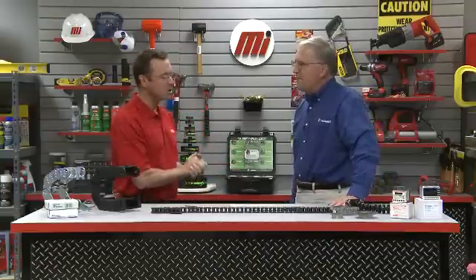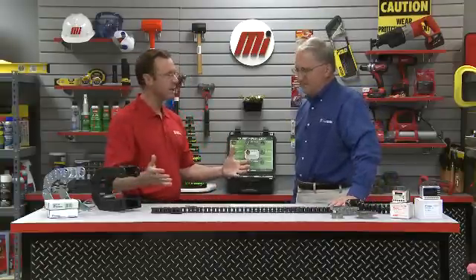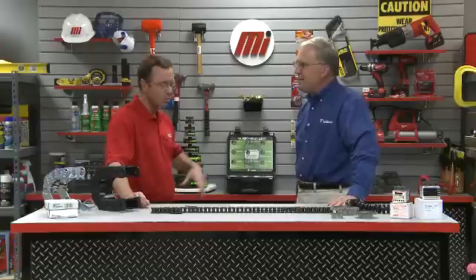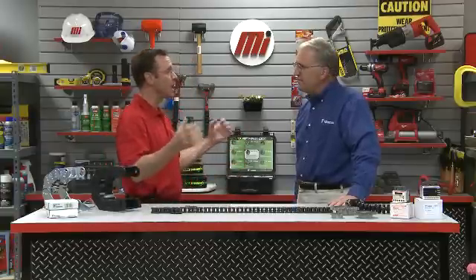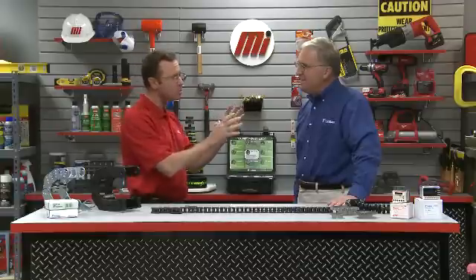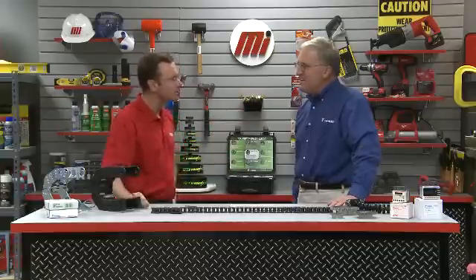Thank you, Tom. We've got a lot of stuff on the table right here — today we're going to review some of the basic procedures for measuring roller chain wear elongation. Before we start with the measurement process, it's good to understand how wear elongation occurs and the benefits of monitoring chain wear. Wear elongation will occur to all chains over time as they run or pass over or engage onto sprockets while under load.